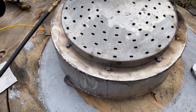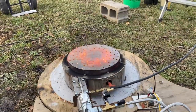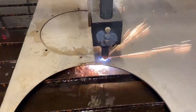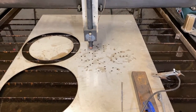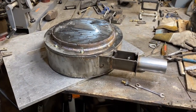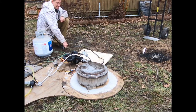So we had to pull a rabbit out of the hat and think outside the box. We put a distribution plate on there — I'm calling this the consolidation plate. We're fabricating a bolt-on consolidation plate that's going to take some of the flame heat from the spouts that are working properly and distribute it to the areas where we're getting unburned fuel being shuttled out the top of the burner plate. If it burns up over time, another one can just be bolted right on there.